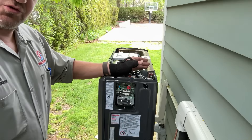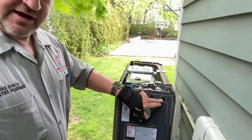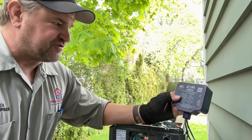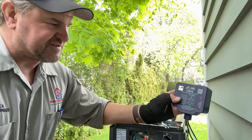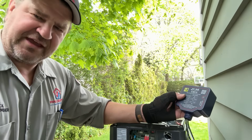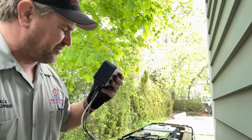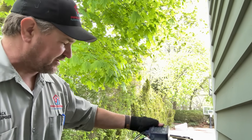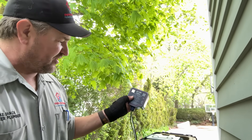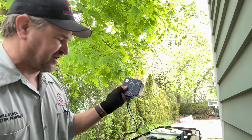It's inverter technology, ladies and gentlemen. This is the future — embrace technology or get left behind. I am working on finishing up the electrical on the outdoor unit. I used a step-bit and drilled out a hole to accommodate the surge protector device I'm using — the ICM-518. This is a split-phase surge protector for 240 volts, and we install this on all of our inverters. I happen to like the ICM — I think good things come in big packages, especially when it comes to surge protection.